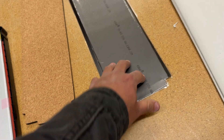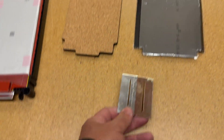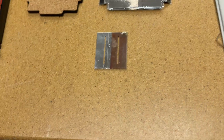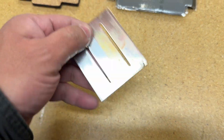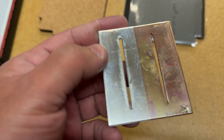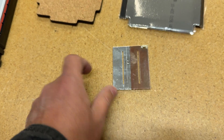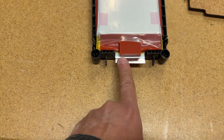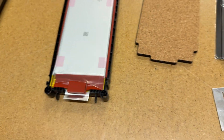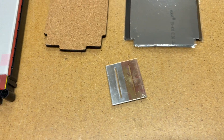You can tell this is thermal material because it's very cold to the hand — it wicks away all the heat. It's probably very expensive material to source, but we have it. The fourth part is the bus bar. These bus bars are interesting because half of them are plated with different materials — this one is probably nickel plated and this one is probably copper plated — because the anode and cathode are different materials: one is aluminum and the other is copper.